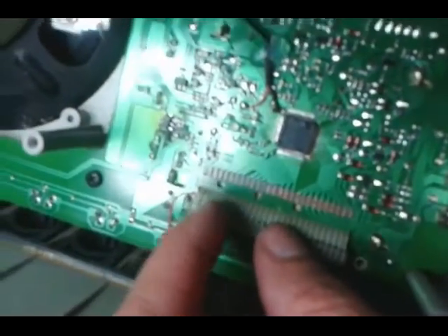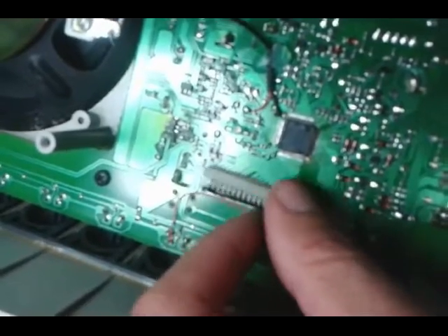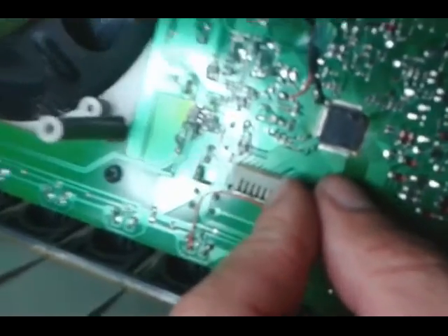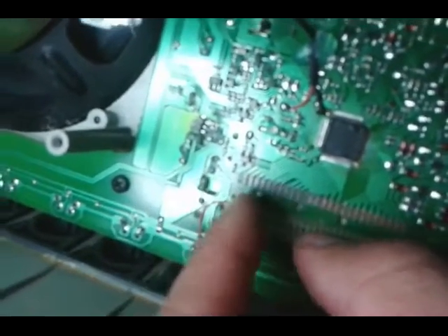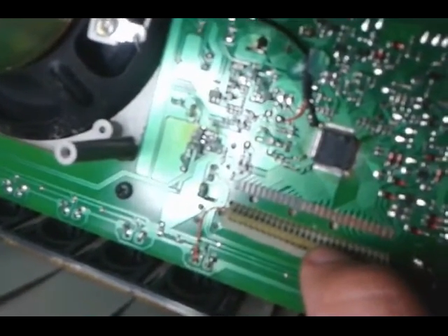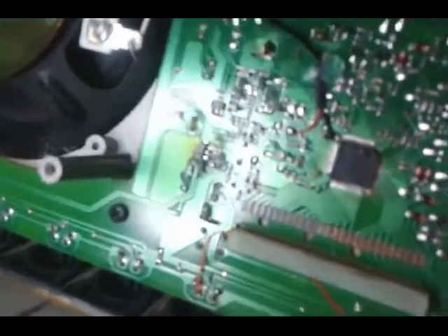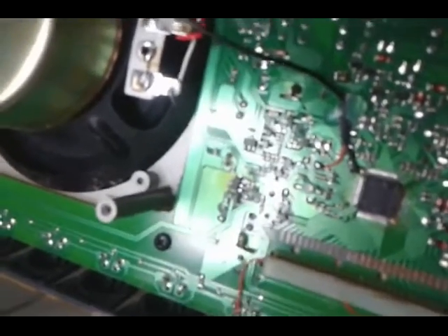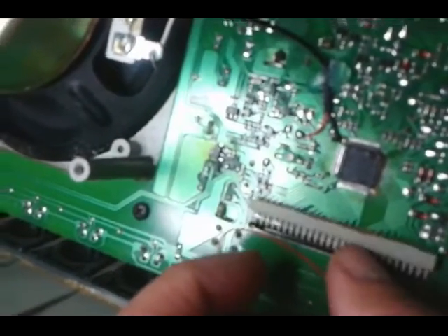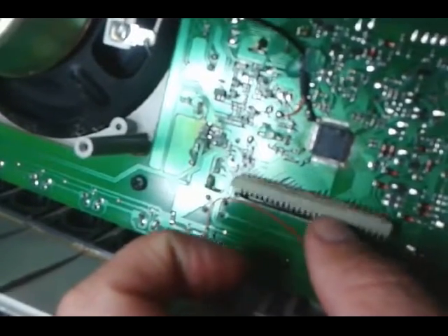Scraping away the bottom of the connector when it rips off — if you can, just heat it up and try the other repair method first. But this method is another way of doing this repair and making sure it connects properly. Ideally the manufacturer would have had a proper connector for this ribbon connector, just like a laptop motherboard has for the ribbon connector off the keyboard. But this company went for a cheaper method, and the result is these failing LCD displays.